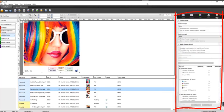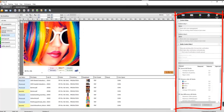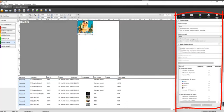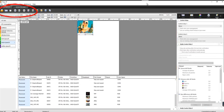Lastly, we have Color Verifier. This allows you to print a control strip that extracts any spot colors within an image and prints a small swatch at the bottom for the spectrophotometer to scan post-print. It looks at the suggested lab values from Pantone when you print and gets a read using the EFI spectrophotometer, reading in the lab values the printer is outputting, and can automatically optimize the print for a new spot color. Once you have the job as you want it, you simply click Save and Print and it outputs a BCO file that you import into Print Control Utility to start your print.